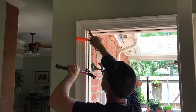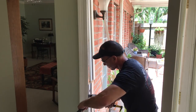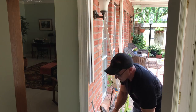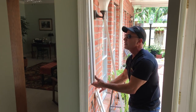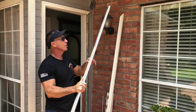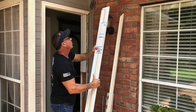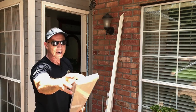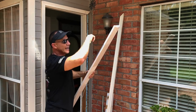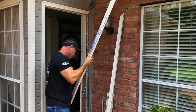The trim is just like the other — it's tacked in right here. So I'm going to pull the trim all the way off the bottom and kind of twist it and pull it out without causing damage. Now we're going to have to cut the top. When you buy a door jamb, it's going to have a notch on the top and the bottom so it can go on the right or the left side of your door. The top is going to be notched, so you just cut the bottom off to the length that you need. What we're going to do is take the shims from behind it and then we'll be able to pop this away so it separates from the top, and I'll be able to get a blade in there and cut it.